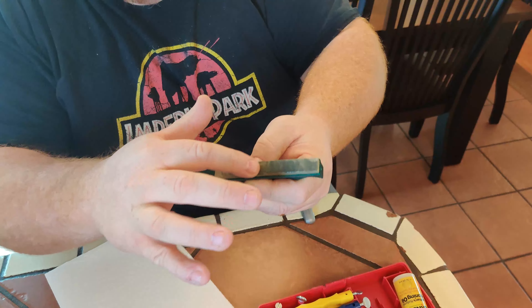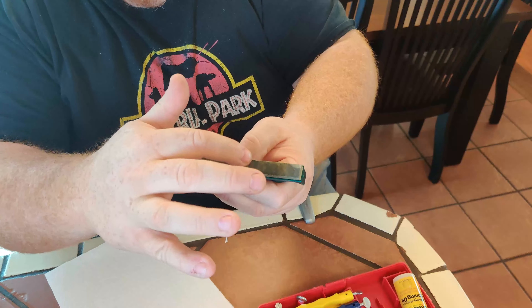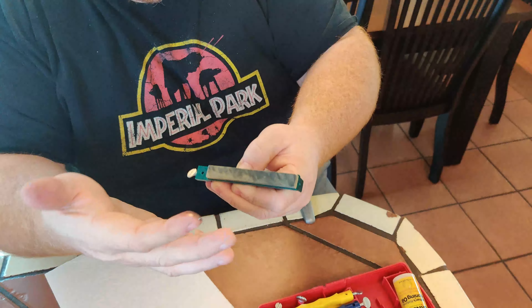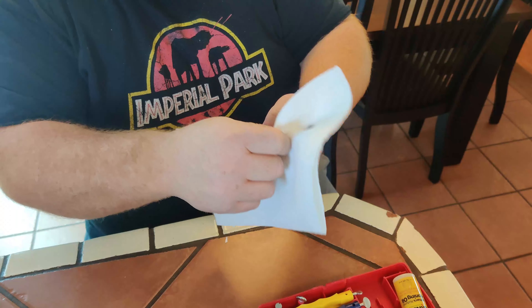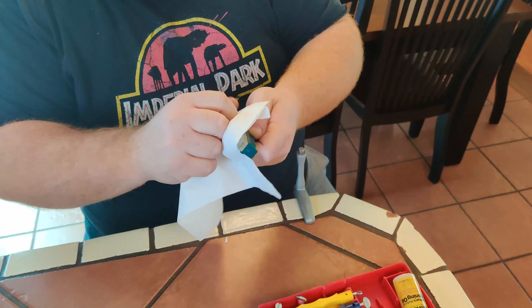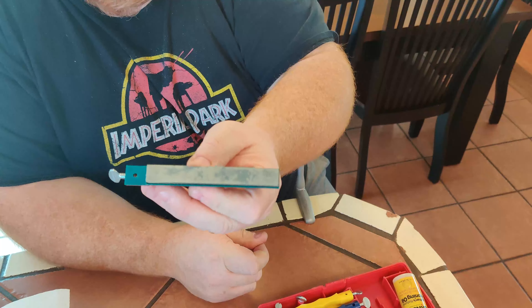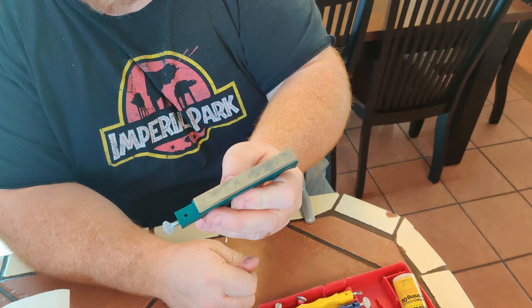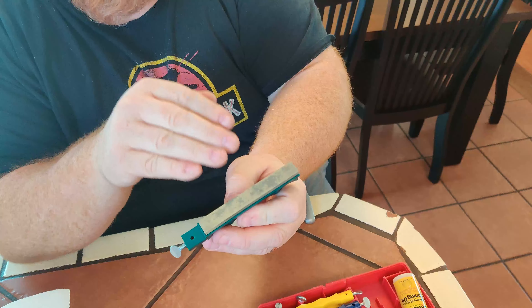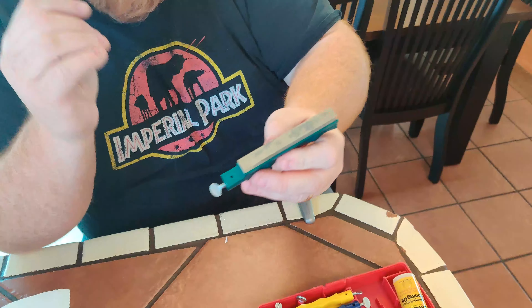Hopefully you can see it on the camera, but you can see that I've gotten a lot of it off. I just have some paper towels here — wipe it off, make sure it's good. What this does is it also works some honing oil down into the stone. Mostly what we're concerned about is we just want to make sure that we actually have an abrasive surface rather than it being all filled in with metal filings.